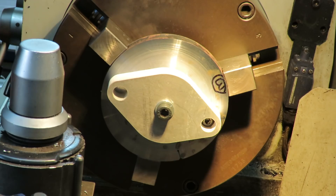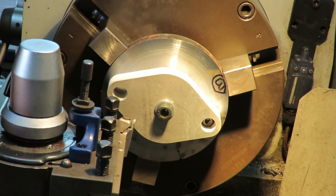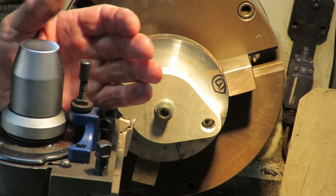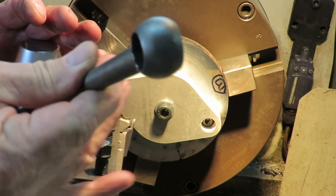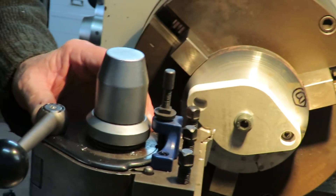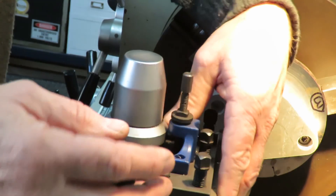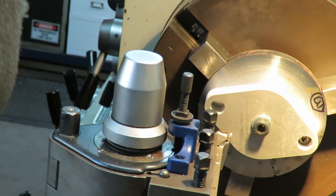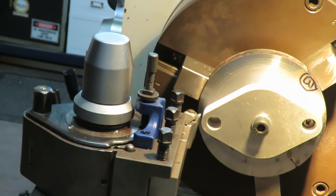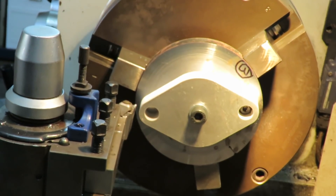We're running at 850 RPM. I love these tools because I don't need handles sticking out all over the place — I just pull the handle off and slide it over. It's such an easy tool to operate. Bring it in, drop it — every 9 degrees you've got a setting. Lock it up — the multi-heads as they're called. I'll bring that around a fraction. Just feel nice and tight.